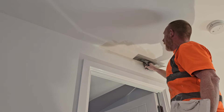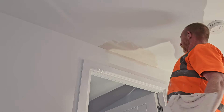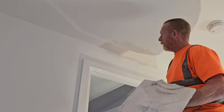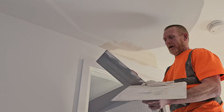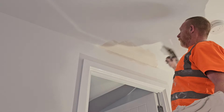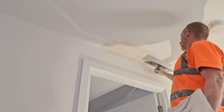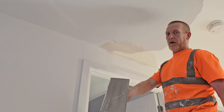You can put my filler on — once I've put my first pat on, I'll turn my trowel on edge and I'm ruling off. I'm trying to keep these edges as fine as I can. Rule off — that will save you on the sanding.